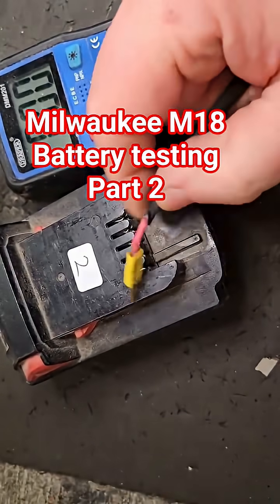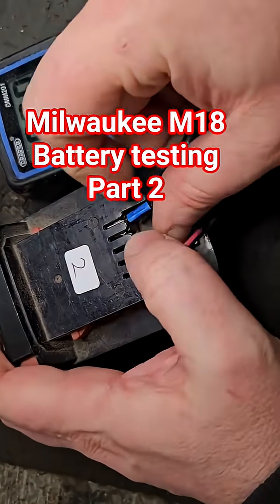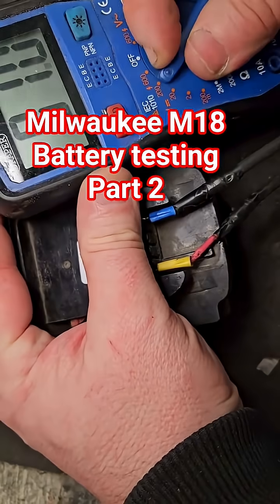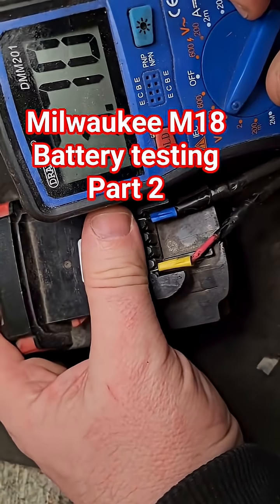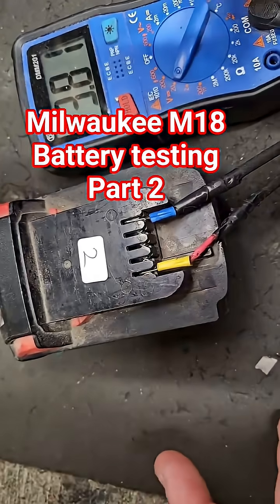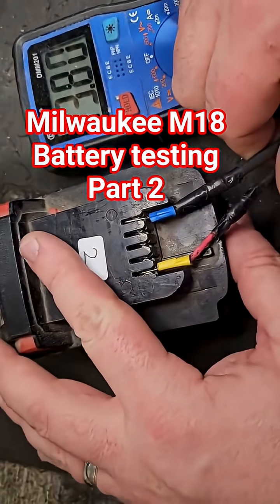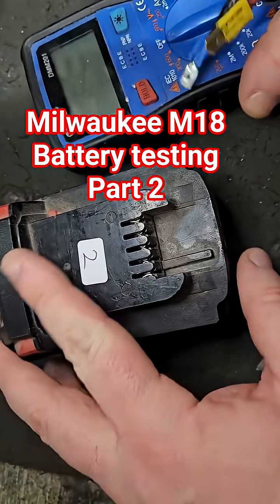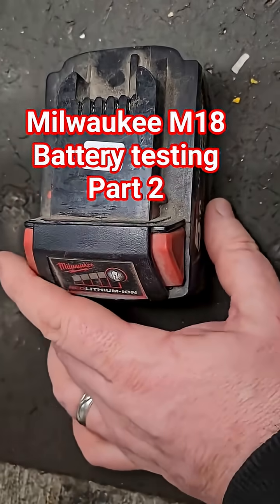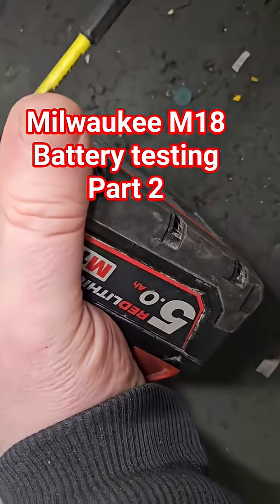We have to see what she's throwing out the top. Again positive, negative. It's showing 13.8 volts. Before opening this, I would guess that we need to do cell replacement in that one. Doing the mathematics, I would say there's probably four cells away in that one. But again, we don't know for sure till we get in there.